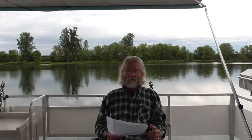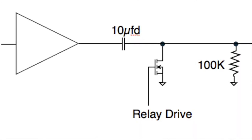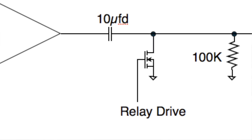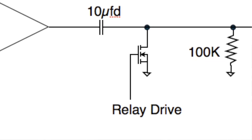Now, if you absolutely have to do AC coupled, you're going to have to consider what the output impedance of that amplifier is. Imagine the amplifier has zero output impedance — then you have a 10 microfarad cap and 100k ohm input impedance. You should be able to do the math on that. I really don't want to speak out of ignorance, but that's how it works.